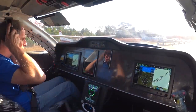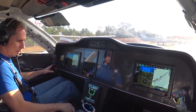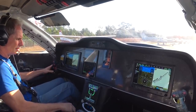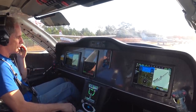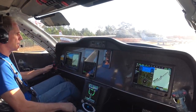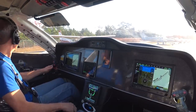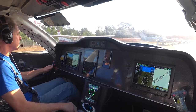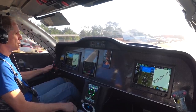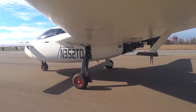I'm going to taxi up and down a bit and see how those ailerons feel and look. There wasn't any coolant in the overflow bottle that catches what comes out of the reservoir — good. I didn't push it hot enough to overflow the system. 240 seems like a good temperature limit, since 250 is where it tends to overflow a little bit.